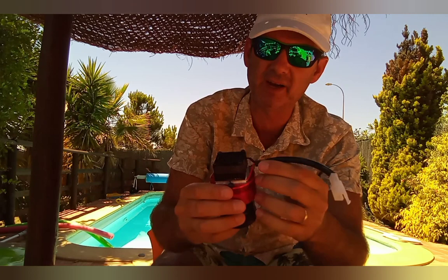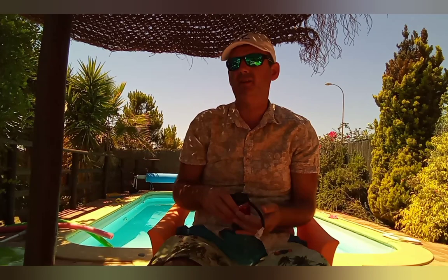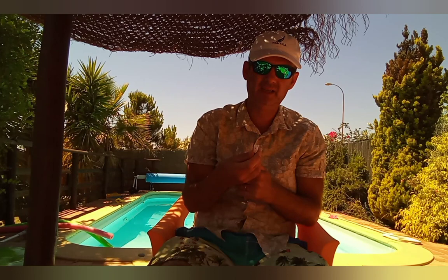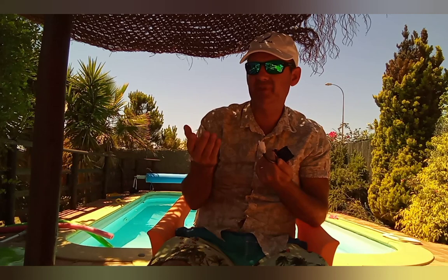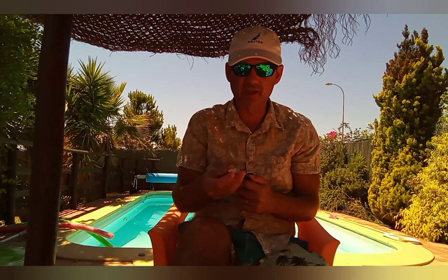So after this, it is very simple. You have the four cables, two from the fan, positive and negative, and two from the peltier, positive and negative. You connect the two negatives to one side, the two positives to another side, and to the connection. You don't need soldering. This is very easy. You can buy this kind of connectors on Amazon or anywhere. They are electrical connectors, they are cheap. I have this at home, so I use this. You just have to crimp with the right tool, and you don't need to solder the cables. I didn't solder because this is so tight that the cables don't fall. So you can use this connection.